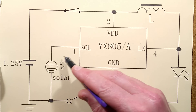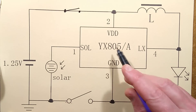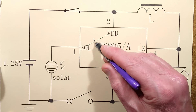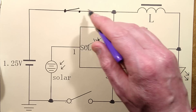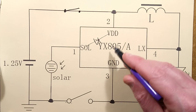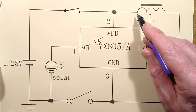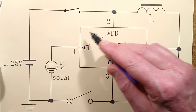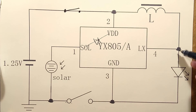It's the usual system — the solar input to the chip goes via not just a sense for voltage, but via a little diode inside to the NiMH cell, and that then feeds the inductor. Normally the voltage from the cell — 1.25 volts — is not enough to pass through the inductor and actually forward-bias the LED.